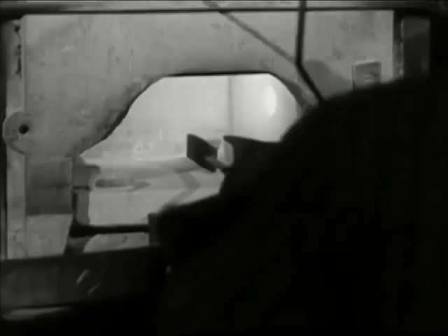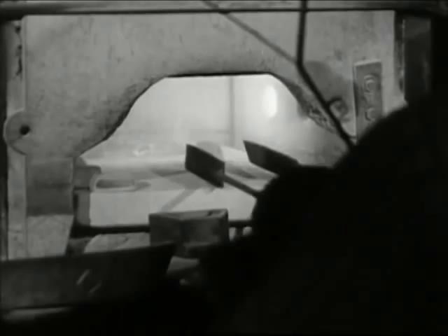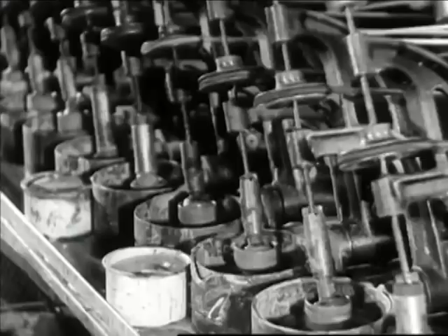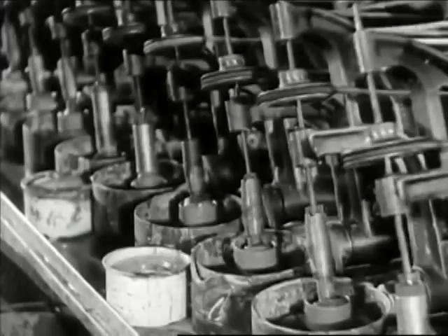For only flawless glass is usable. After rigid inspection, it follows one of several courses. Here it is being reheated, and after pressing, becomes blanks for fashioning into lenses and prisms of scientific optical instruments. When extreme curvatures are called for, blanks must be individualized on machines like these. Blank prisms are mounted on blocks, and the blocks are then prepared for prism grinding — a highly specialized process.